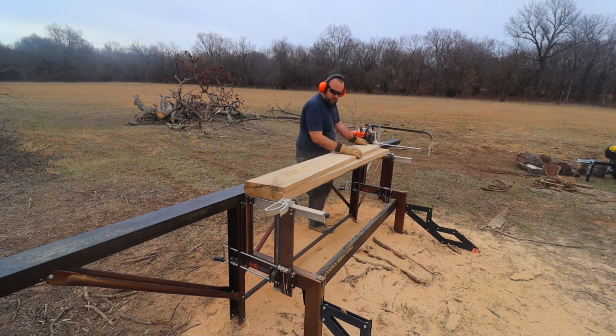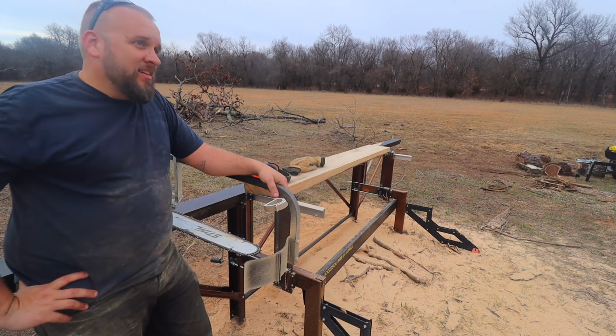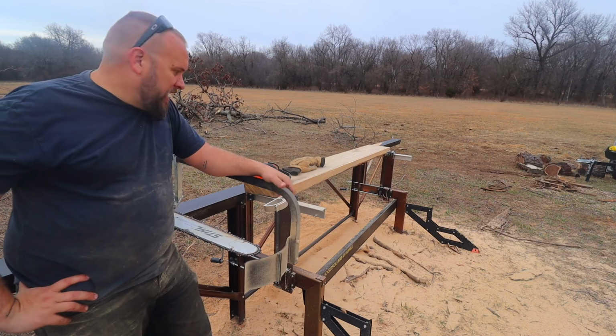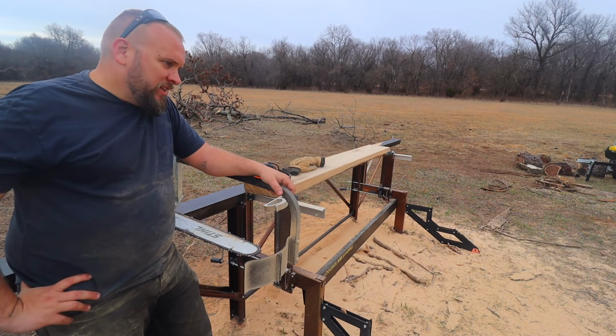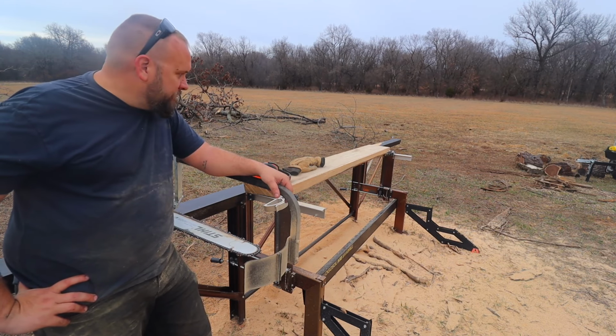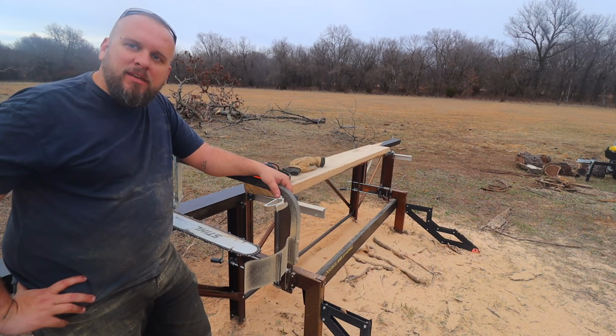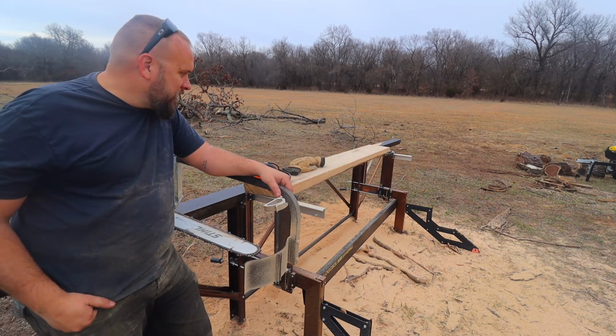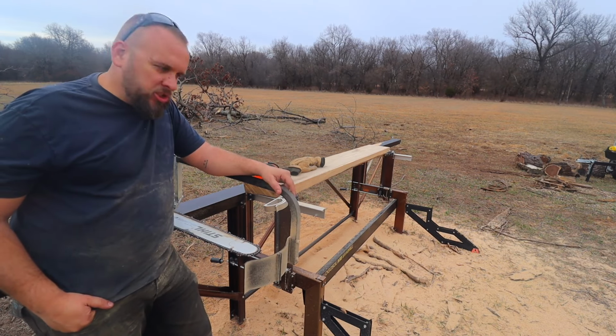That last piece there is 2.5 inches thick. It's really pushing it. I've set it where it's going to clear that stop. And the piece I'm going to have on top is about 3/4 of an inch, which after drying is going to be 1/2 inch. And if it warps, it'll be almost unusable. And then I'd have one piece left that was 1.25 inches. I don't think it's worth it to cut that. I'm going to keep that and use it as a thicker piece. I would say when you get down to about 3 inches, you can cut that in half, but that's about the limit. 2.5 seems like it's pushing it.